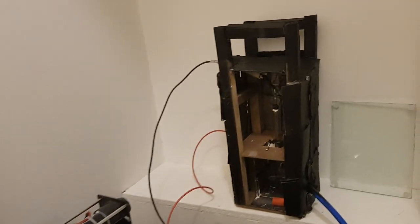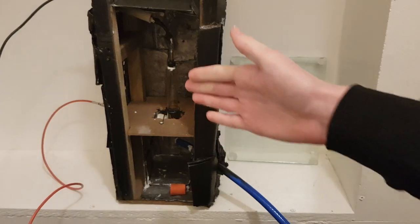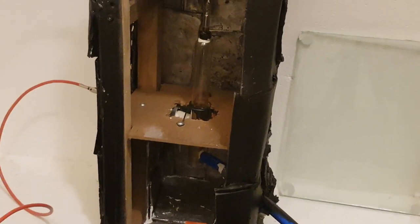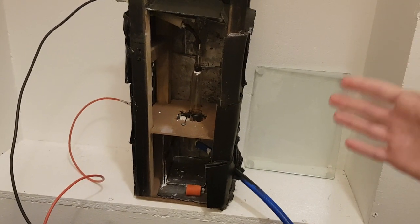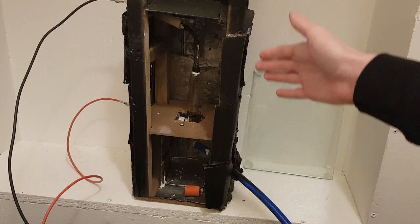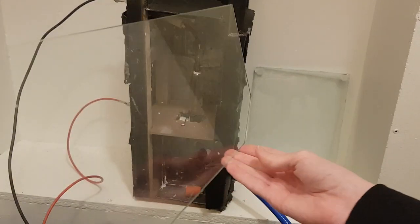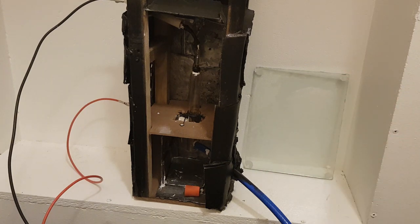Taking a closer look at the tube, you can see it's in the middle of this lead box — certainly no masterpiece, but it does the job incredibly well. The reason for the lead is because I'm a good boy now and don't exceed the regulatory limits. I have to utilize this lead and also some glass panels, which will be put in front of the apparatus to shield any parasitic x-rays being generated, though at the voltages I'll be using it should not be much of a problem.